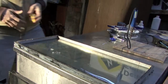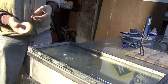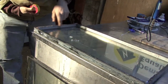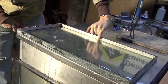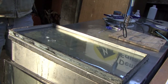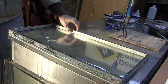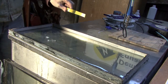The first thing we need to do is run electrical tape — though you can use gaff tape, masking tape, or anything non-conductive and sticky — along the inside of each side of the pane. Because this metal here, if it came into contact with any of the cells (and remember they're quite snug, so it might), will short-circuit the panel. So we need to make sure that if any cells do end up touching this metal, they don't short-circuit because we've put insulating tape on it.